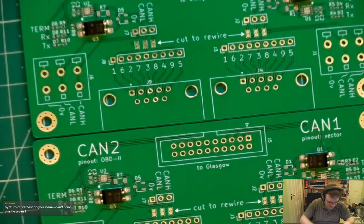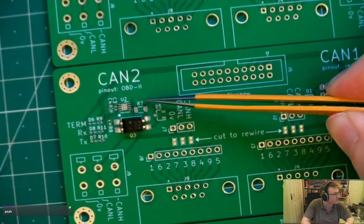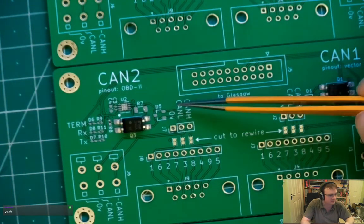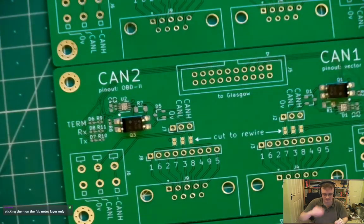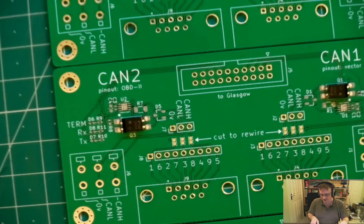You can see here things like R7 and D5 — those are called reference designators and they tell you what the component is when looking at the schematic. You can turn them off and not print them on the board, or leave them on and they're everywhere. It is actually an entire step in a big design to place the reference designators so that they are legible — not obliterated by a pad — and so that they correctly associate with the component they're pointing at.